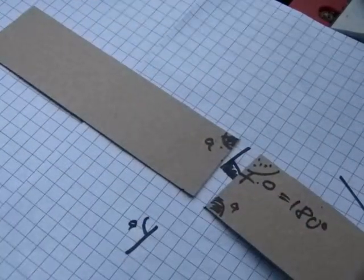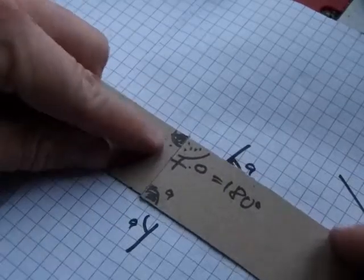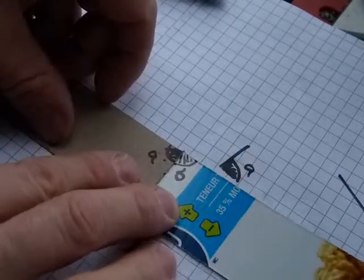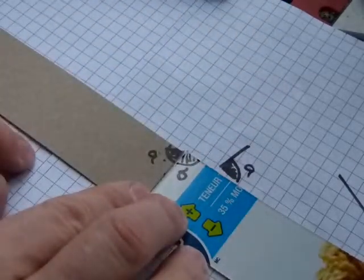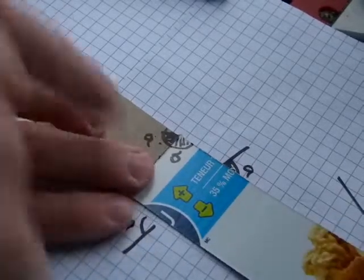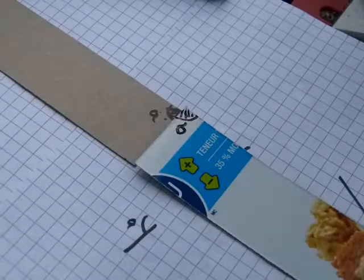So, to make a test cut, I'm going to cut a piece of wood with two parallel edges along one line, and I'm going to flip only one of the two halves, and that way two acute angles will rotate to be adjacent angles now. And we know that two acute angles do not ever add up to be 180 degrees.